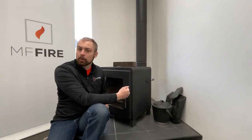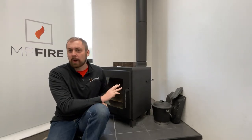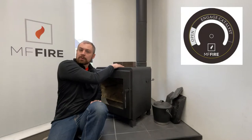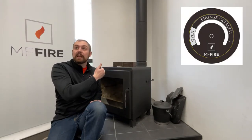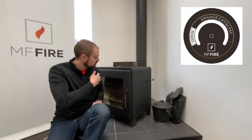The first situation where you'll use the bypass handle is when you are first starting the wood stove. You'll swing the bypass forward into the open position, open the door, load the wood, and light a fire — you can make a top-down fire, and we have a nice video about that. Then close the door until it's open just a crack, about an inch or two, and leave the bypass open as the fire grows so the stove can really heat up. All of our stoves are equipped with a catalyst thermometer, which sits here on top of the stove. When that catalyst thermometer says 'engage catalyst,' it is time to shut the door, close the catalyst bypass, and enjoy the fire.